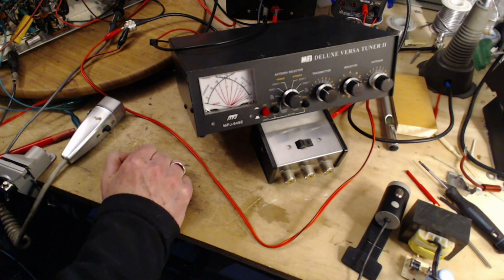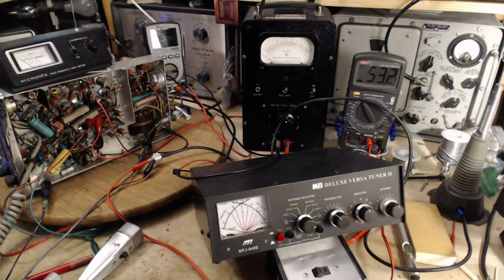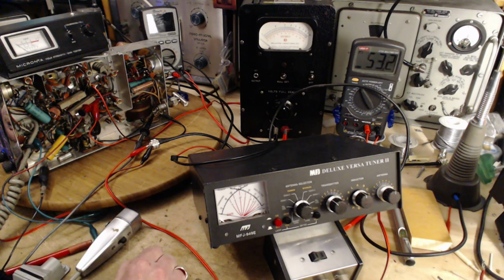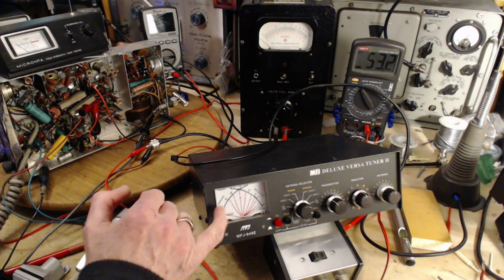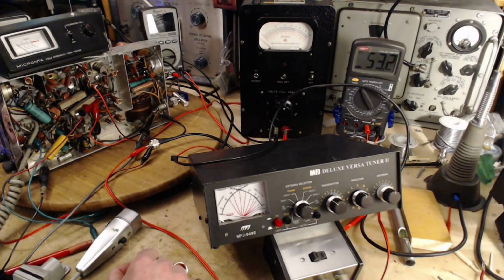What's this all telling us now? The voltages coming out of this radio are on the order of 10 and 20 volts, something of that sort. This isn't like a ham radio pumping current into a resonant antenna and creating a reactive voltage of thousands of volts at RF. You can easily burn yourself, and that's one of the things I've been a little worried about, but I've never heard of anybody burning themselves on a little radio like this. And by the way, when I'm using my ham radio, I'm transmitting similar amounts of power, 5 and 10 watts, shown on this meter, for the things I do on ham radio. I'm not putting out 500 watts into some huge antenna above my house. That's not what's happening here. It's a trickle onto a piece of junk antenna, but it's good enough these days.